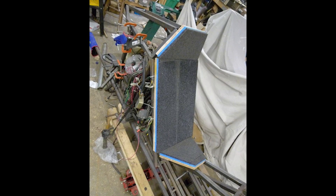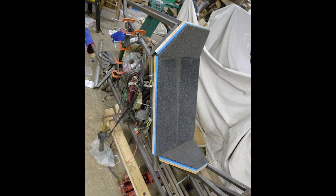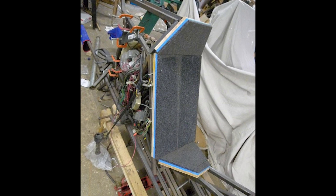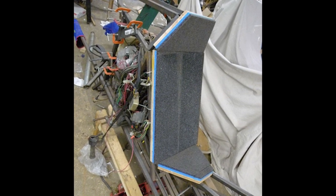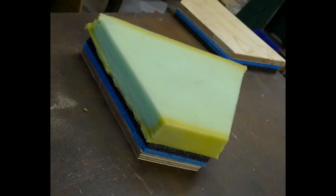So first I updated the seat. I'm sticking with the plywood backing for now, but this time I have three layers of foam of various densities — higher density foams are stiffer and lower density foams are softer. Here is a quick mock-up of the seat backing with the dense foam layers: the green soft thick foam, the black medium density foam, and the blue densest foam, all quickly hot glued to each other to remain in place.